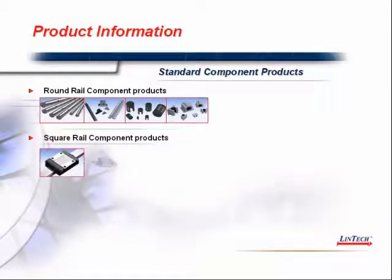In 2009, Lintech began offering profile or square rail linear bearings and rails. There are several styles, but all offer a 45-degree contact with the ball for high loading in all directions. The bearings also have oversized balls to offer higher loads than many of its drop-in competitors. Currently, we are only promoting these sizes which we have inventory at our facility.